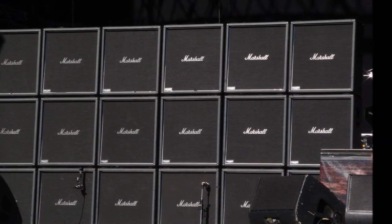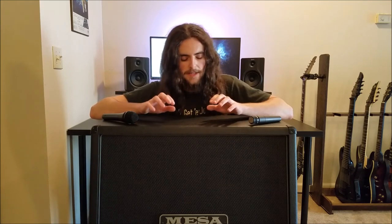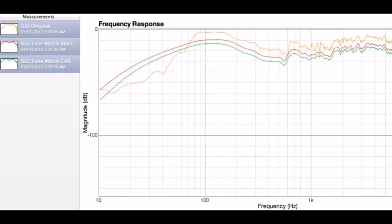As you might have guessed, guitar speakers meant to be paired with amplifiers are neither full-range nor flat-response. They are specifically tailored and designed for guitar amplifiers to produce the iconic sounds we're used to. Depending on the speaker model, the cabinet they reside in, the number of speakers, arrangements, and sizes, it will produce a different sound. Take this Mesa Boogie Rectifier cabinet — it's 4x12 inch speakers loaded with Celestion Vintage 30s, which have a different frequency response curve compared to something like G12s — and that frequency response is what you're trying to emulate in impulse responses.